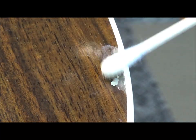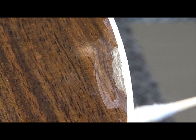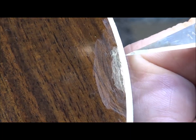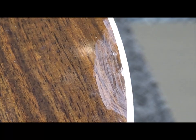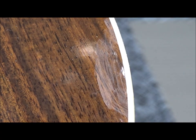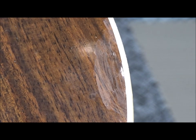I'll go with the little paste wax again just in case we get a drip. This time I'm probably going to just let it dry in the position that it was in. I'm just going to wipe this little bubble off — and that's it, that's what I wanted right there. I can hit it with some accelerator now. You want to wear a respirator or a mask if you're spraying this stuff all day long in your shop.